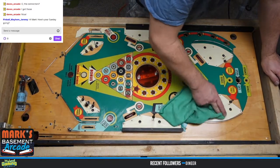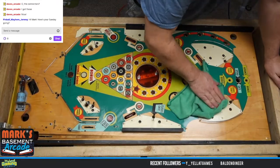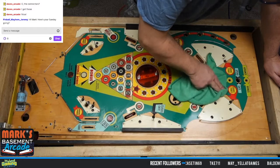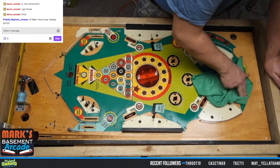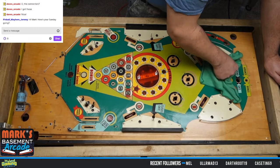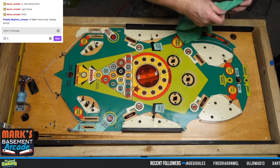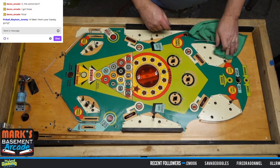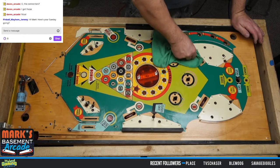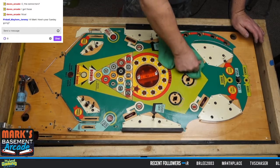But the MPU needs love. It's doing its job. And I just looked for NVRAM, and they are non-existent anywhere. No NVRAM anywhere. Everything is out of stock due to chip shortage. So I will probably just be putting a battery backup board on it and leaving it as is. I don't know if a super cap will work on this game. Will that work on it? Because we didn't get it to work on what do you call it? The Solar Fire. So I don't know if it's going to work on this or not. That's looking good.